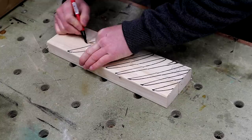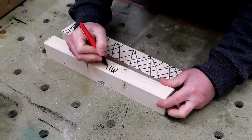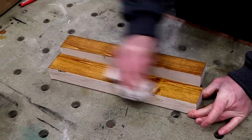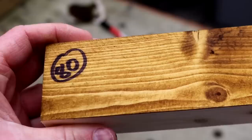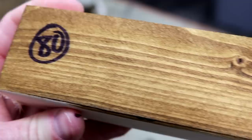The next thing I want to test is the quality of the finish. I put marker pen lines onto two pieces of spruce — a very soft wood which is prone to showing pigtail marks and sanding scratch patterns. I fitted a brand new 80 grit disc to both machines and sanded both boards until the marker pen disappeared, then applied dark oak wood stain to highlight the scratch patterns. The Hivst showed minor pigtail marks, which is no surprise at 80 grit, but generally the finish was pretty good. The Merker, however, seemed to show more noticeable pigtails when compared side by side with the Hivst, which was a surprise.